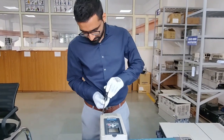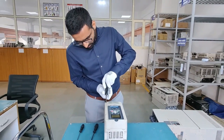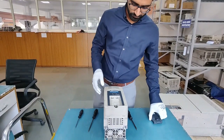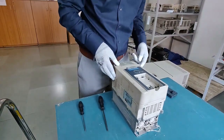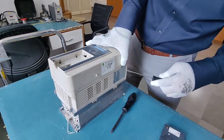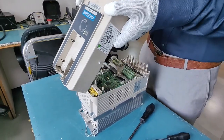I will first start with opening the front cover. I will loosen up this screw. We can remove the display by pressing down here and simply remove it. Now you will see there is a spot over here and we can simply press it and your cover will come out, or we can use a screwdriver to press it here and the cover will come out like this.